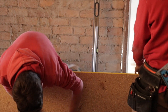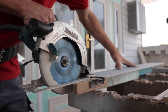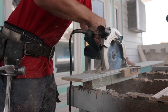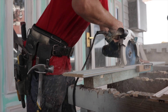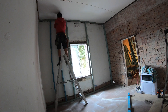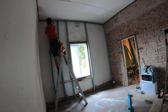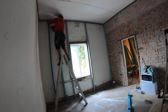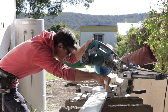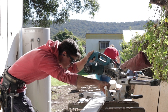We can move on to framing up the walls. As you know, in this room I absolutely was done with battening. With that in mind, we're framing out around the window on the northwest side, framing out the western side, there'll be cabinetry against the southern side, and on the eastern side, in the interest of not having enough width in the room to fit in my cabinetry, I'm going direct stick onto the brick.